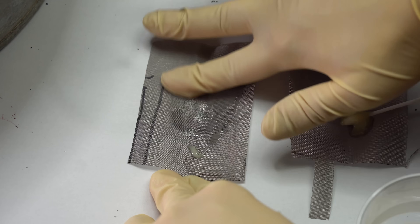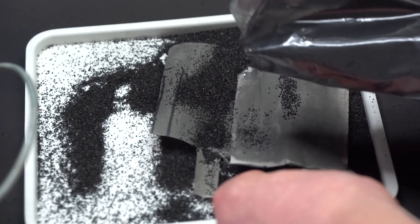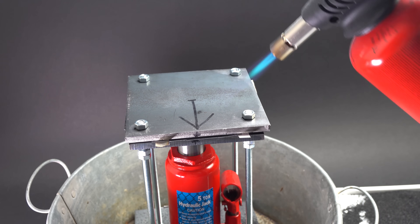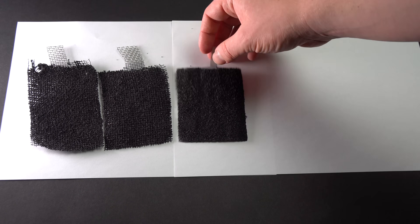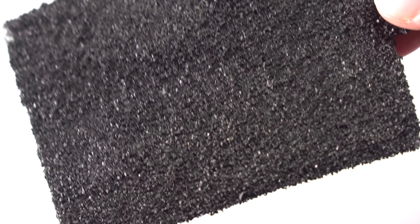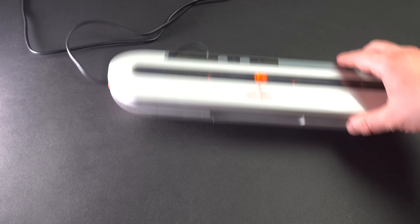After that, I need to make six more for my experiment. In total, I got eight different cathodes — four from the mesh with wide gaps and four more from the mesh with narrow gaps. As you can see, the carbon sticks to the current collector very well. When I measure the resistance, I can see it is quite low. Now we can begin assembling the battery itself.